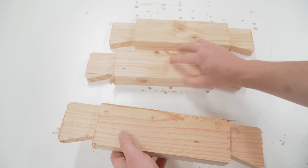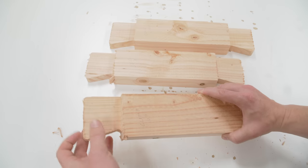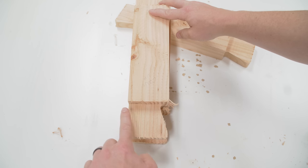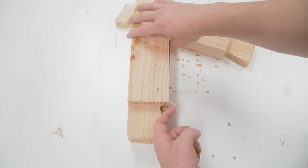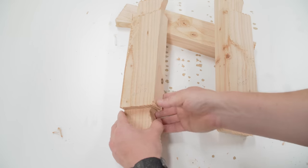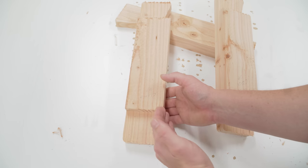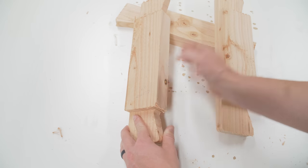What about climb cutting — changing the direction of travel while still using an upcut bit? A little bit better: still have fuzzies but not the nasty blowout. What's happening is the bit is traveling in one direction and just blows out the edge. With the climb cut we're starting from the other side, and I think my vector was just too close to this edge — I probably should have gone off a bit more so we had a clean entry cut rather than pushing in and cutting as it turns. Still some tear-out, but nowhere near as bad.